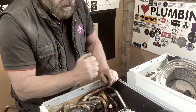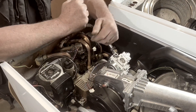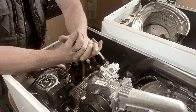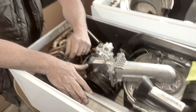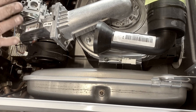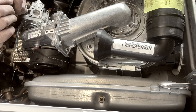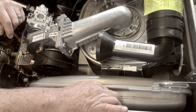We've done the heat exchanger and we've done the plate-to-plate heat exchanger. What happens when water heats up is it expands, and it has to have somewhere to go when it expands — so that's why they have this. It's an expansion vessel. You might have seen them with this — it's a Schrader valve, exactly the same as what you have on your car tyres. Sometimes they get full of water — you can press that and if the diaphragm inside is broken, water can come out, telling you that it's broken.